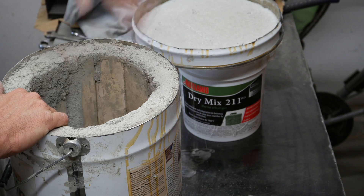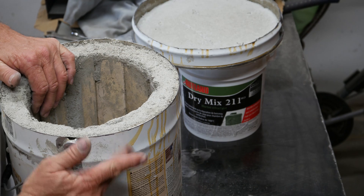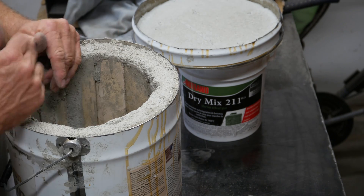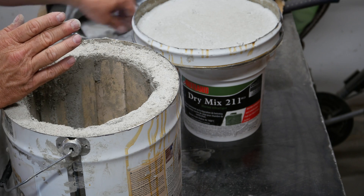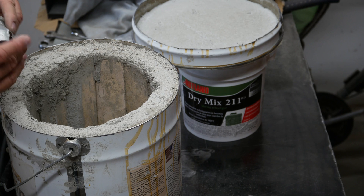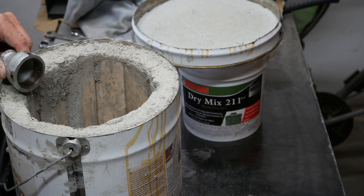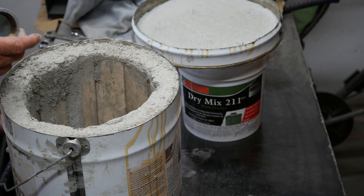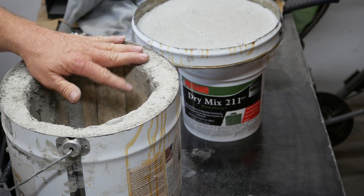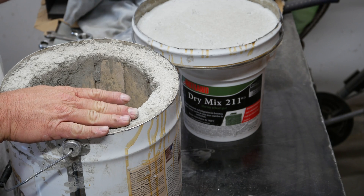Probably the next time you see this, it will be lined, this will be finished, and I might even have the hole cut through the side. Something else — another brilliant move, Perry — I didn't cut the hole in the side first, so I'm going to have to try to cut a hole through all of this stuff. I don't know if it's even going to be possible. I may have just totally hosed myself, but I've got to put the thing in for the burner. I'm going to go with a size that will fit a flare on the end — one inch to one and a half inch flare. I'm going to drill a hole into the side so it will fit in here like so, and I'm just going to leave the flare so I can take the whole flare and nozzle out if I want to. That's one thing I'm going to do a little differently, based on conversations with other builders — make the hole bigger.